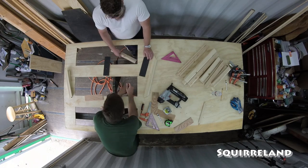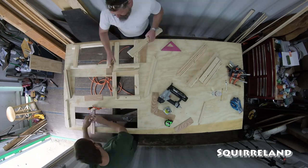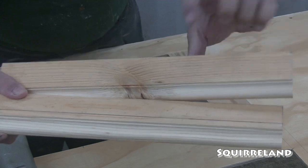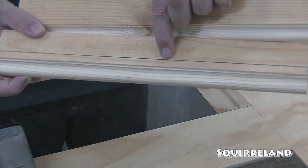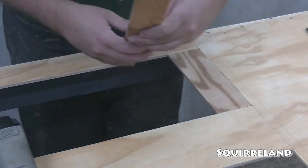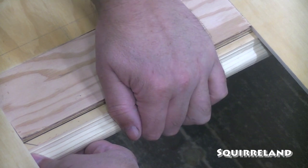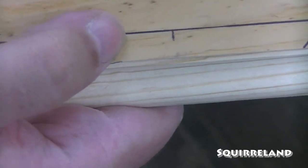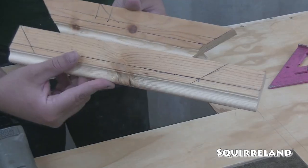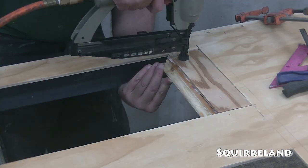Finally, we can get to assembling this thing. I'm going through and marking all of the inner trim boards at one and a quarter inches from the back, then marking one side with a 45 degree angle. I take that board and place it into the hole in the panel, line up where my two lines intersect with the corner, and mark the other side across the first line that I made. Then I draw another 45 degree angle that intersects with that mark and I'm ready to cut the board. After they're cut, I hand them over to Jason so he can glue and nail them into the panel.